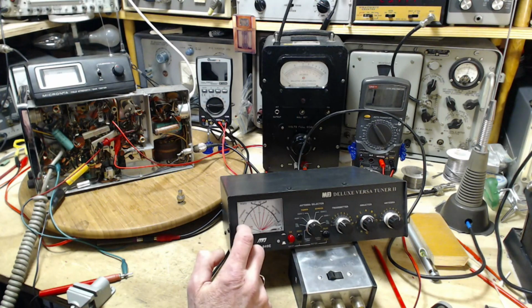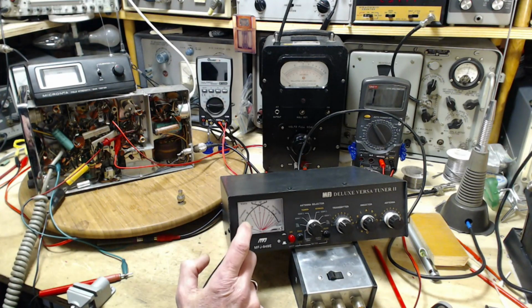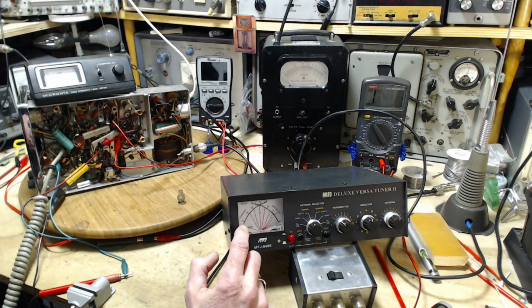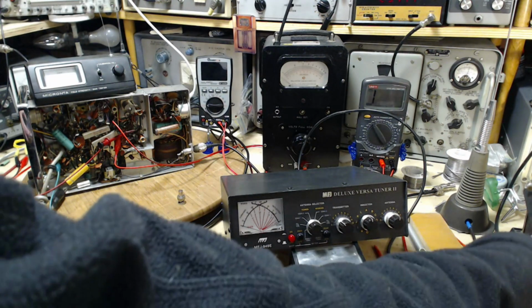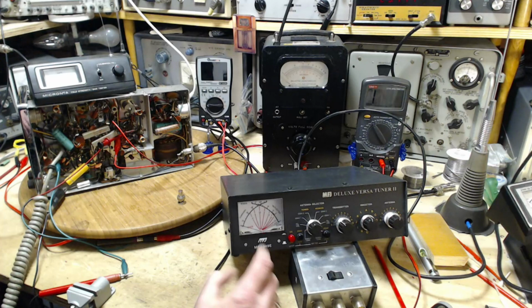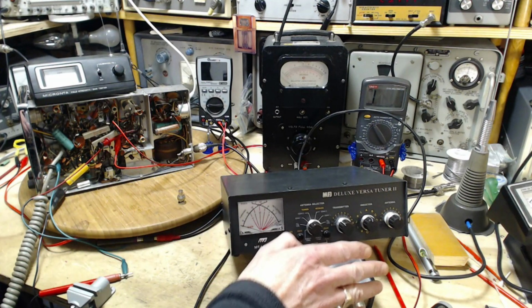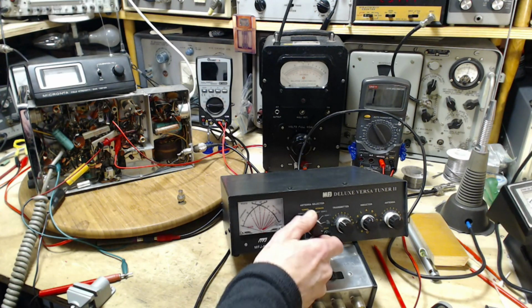Okay, so on the 300 scale... Oh, I'm reading this wrong. Back it up. It's not 10. That's 1. 1, 5, 10, 20. Yeah, yeah, yeah. Come on, Jim. 1, 2, 3. So where are we at? Roughly 2 watts. That was really very similar to the other reading on the El Cheapo meter. Good. Reflected power. Watch the other meter now. Yeah, it's not even moving. So all the energy is being dissipated in the internal resistor in there. Let's switch this now.